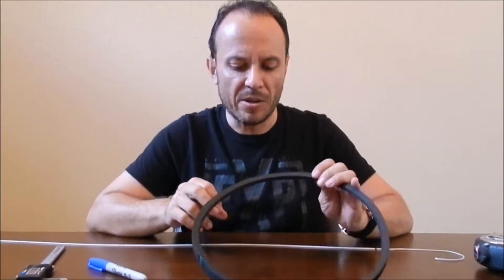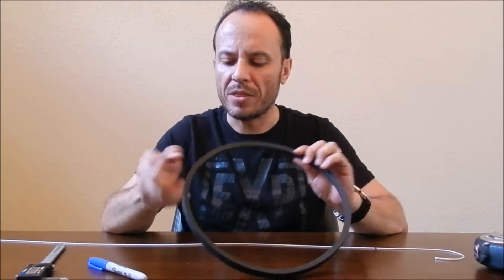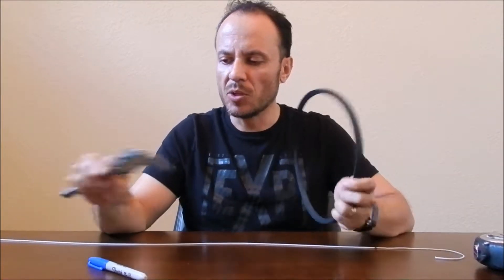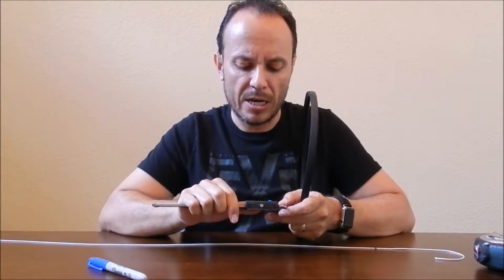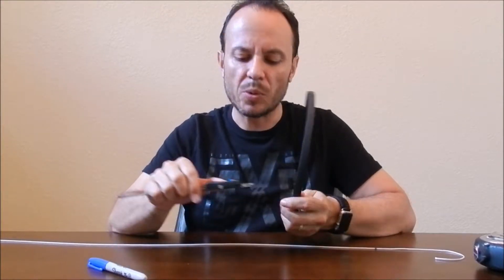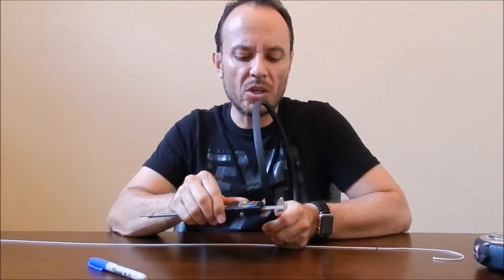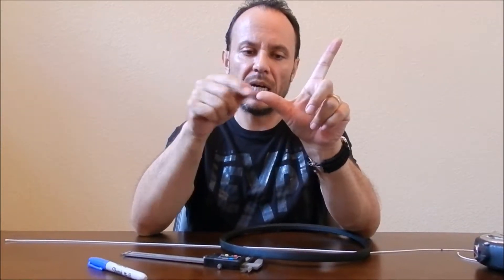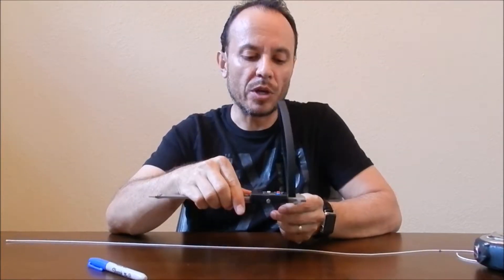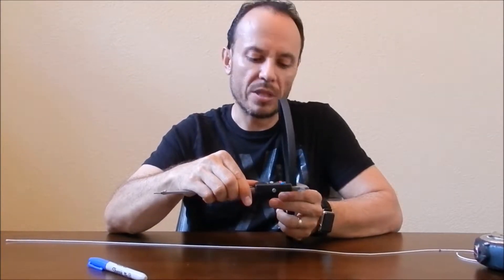The second thing I'm going to need is the width of the belt. I'm using right now a caliper. You can also use the flat tape to do it. Basically what you do is measure exactly what is the width of the top of the belt. Remember, V-belts have this shape where you have an internal width that is smaller and an external width that is larger. That's the top width we're going to measure.